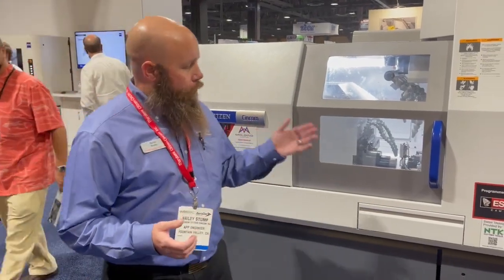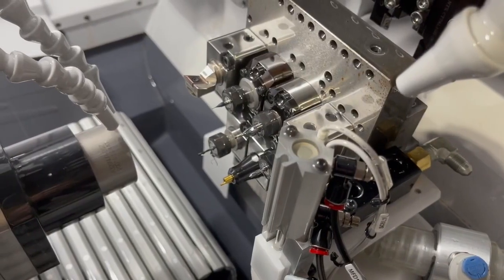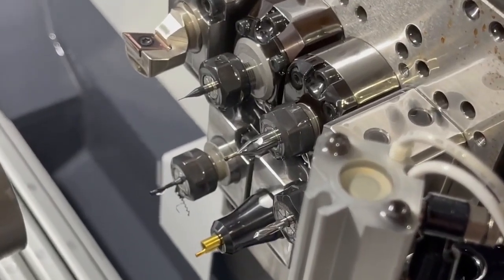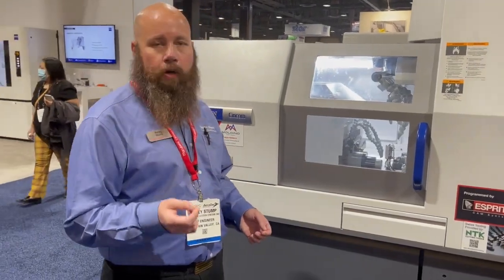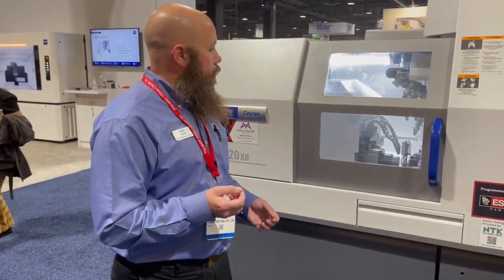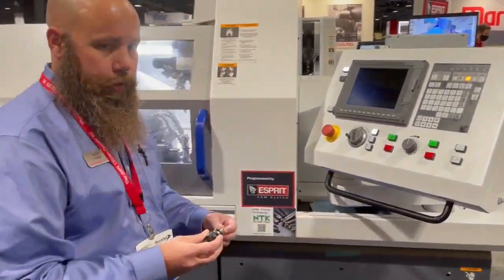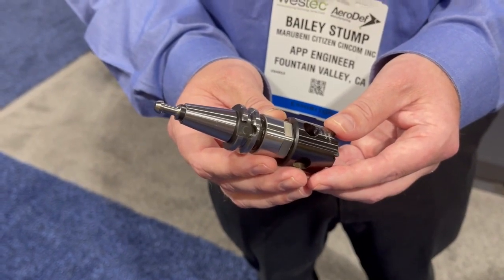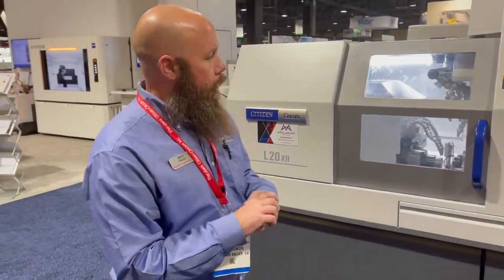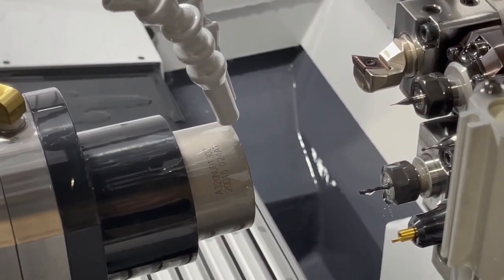The ATC can hold up to 12 tools. With a fully programmable B axis, that's 12 tools assignable to the T12 position and one tool assigned to the T11 position, giving you a 13-tool capacity with a 12,000 RPM max. The tool holders fall under the JBS 15T standard, using an ER16 collet system — a 3/8 diameter shank — with a tool stick-out of 30 millimeters and a maximum tool diameter of 30 millimeters.